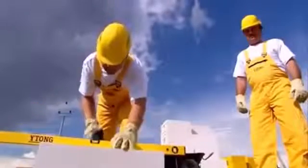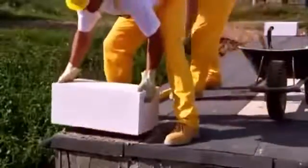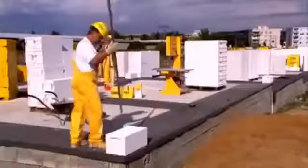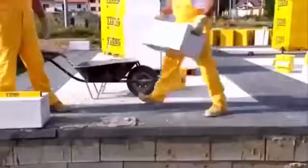Layer of lime cement under the whole surface of the block. Make the block stable by tapping on it with a rubber mallet. At the same time, check the block is level in both directions. Using a spirit level, check the height setting of the blocks in all corners. Stretch a line and start to build the wall. Lay the first tier of blocks in lime cement.